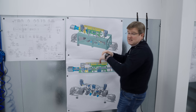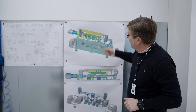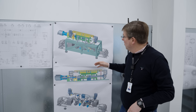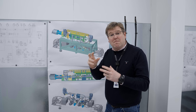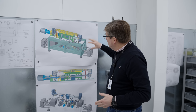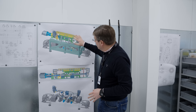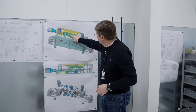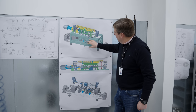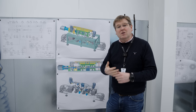We've got two of them running back to back - we wind a cross shaft up so they're constantly pushing against each other at maximum torque, and we can run that all the way through to full operating speed, 5,000 hours, and qualify that these things work in terms of the lubrication system, balance and rotor dynamic stability, contact patch development between teeth, and all of the little niggly details that these complicated systems have can be worked out on the bench before it goes near an engine.